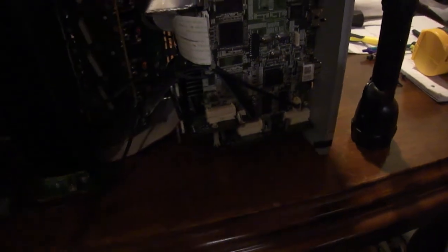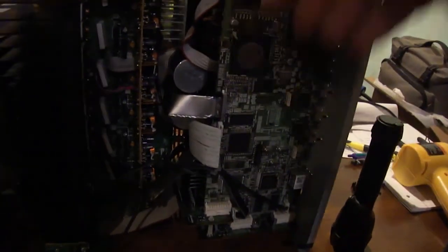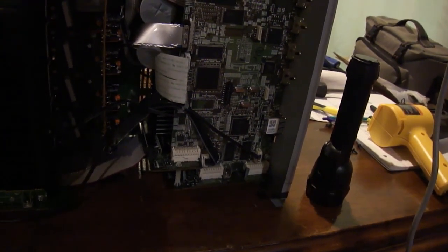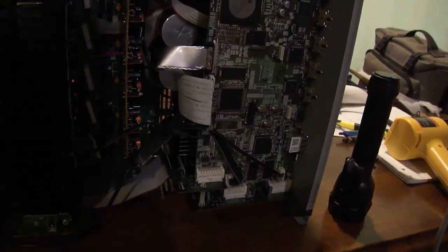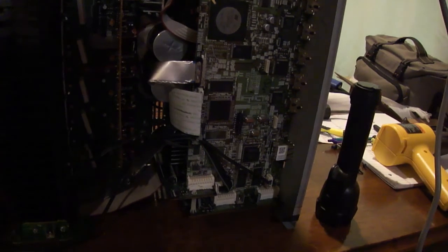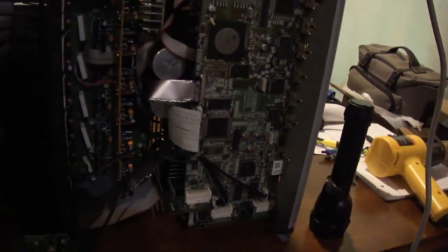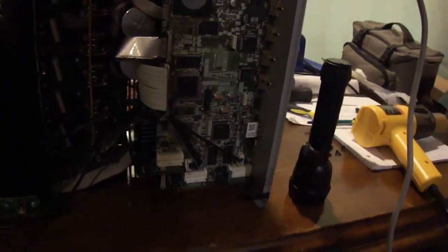In the early days of surface mount, when they were assembled, they were glued in place with a glue nozzle on the pick and place machine, because they were wave soldered. Now it's all reflow solder today, and I've personally seen those type of systems in action, because there's a company in the same building as my company called Tectone, and they have a full manufacturing facility where they manufacture component loaded circuit boards and reflow soldering and wave soldering and all that stuff. So I've seen it all in action.